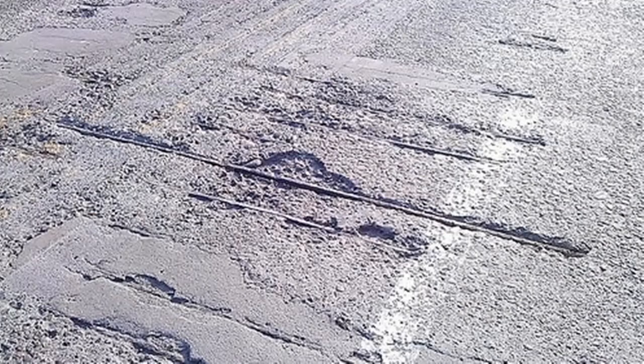Now, another thing to understand with each of these treatments is that the surface can be applied as a built-up overlay, which raises the grade of the surface, or you can actually remove a prescribed depth of material and place back HPLMC as an inlay so that you are not changing grade. Both techniques have their advantages and disadvantages. With straight overlays, very minimal material may be removed from the original deck.